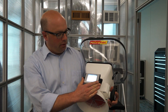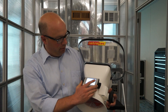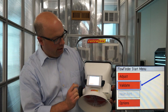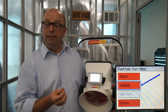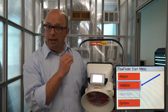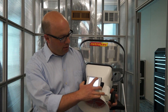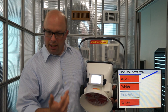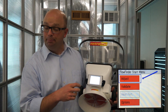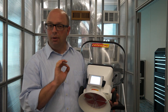You can set this for either validate or adjust. If you set it to validate, that's going to do either return or supply CFM measurements — you can validate the amount of air coming through that supply or return. When you're doing an actual air balance, you set it to adjust and it does a continuous measurement of the CFM flow so you can make adjustments with the dampers throughout the system to arrive at the correct airflow per room.